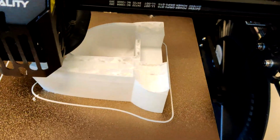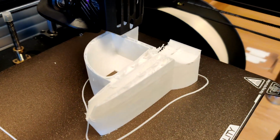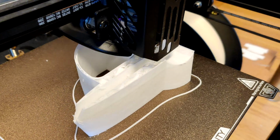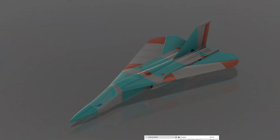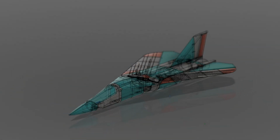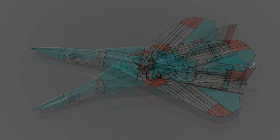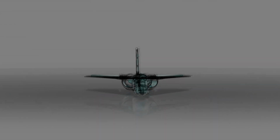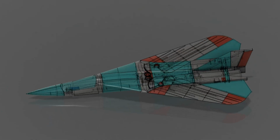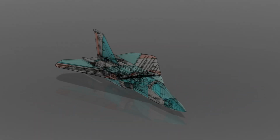One thing that I haven't mentioned is that there's actually no carbon rods along the fuselage. The only carbon rods inside the fuselage are actually there to reinforce the area around the swing wing mechanism, and I'm not using any reinforcements along the length of the fuselage, because I am expecting that the slightly thicker outer wall width that I'm using is enough to handle most of the loads, but that is only a theory. It worked for the Fury, but the F-111 is heavier, larger, and longer, and it's not guaranteed that that will work. So a lot of testing will be done with that first prototype. Probably a lot of it will already be done before it ever properly lifts off. Because if I try to full send the plane and then something goes wrong and it crashes, I need to rebuild the entire prototype and can't make any progress while I'm doing that.